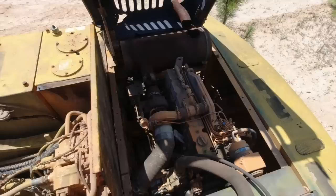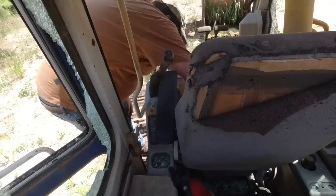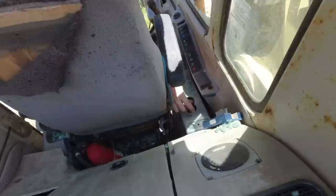Well, the safety switch here inside this cab is broken. What you were talking about earlier? Oh, yeah. That won't be good, because it's turning over good. So due to the safety wiring here, we might have to manually open up the fuel shutoff solenoid so we can get some playtime out of her. Unless we sit in here and try to rewire the safety circuit. You want to turn those lights off, switches off? I found an emergency shutdown over here. So let's see if we can pull this up and see if we can start it.